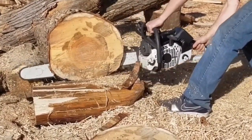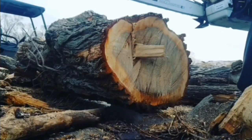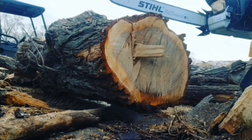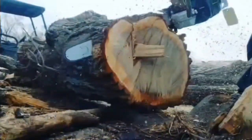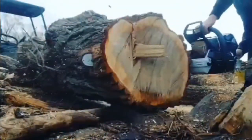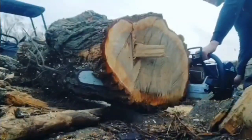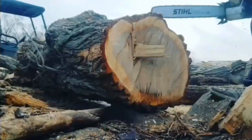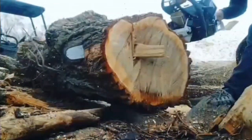My whole point is I'm here to help. Until someone can show me on video — never cut, never edited — take a compression of 130, I'll even give you 140 psi cold, throw a plug in it, start it up, warm it up, make a cut with a 36-inch bar and bury it in a big cut. That's all I've wanted to see from the beginning, but nobody will show me this, and that's where I draw the line.